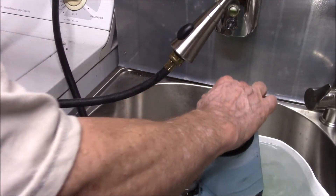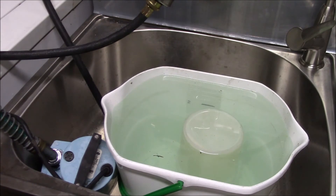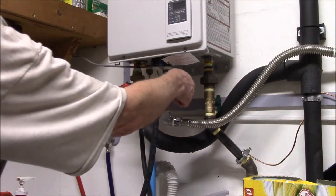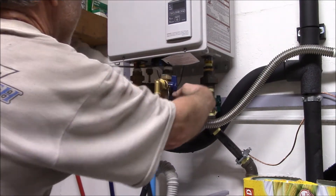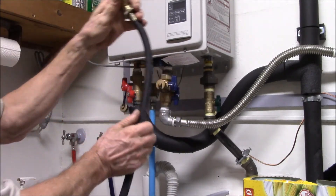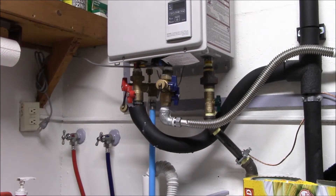I set the pump off to the side to dry, then shut off the cold water after flushing through the heater a couple of times. Then I remove the lines and drain the water out. Basically reversing all the valves — close the two service ports, open the hot line back up, then the cold, and remove the hoses. I'll put a link to these fittings — I picked them up on Amazon and the tabs and right angle design make them really easy to use.